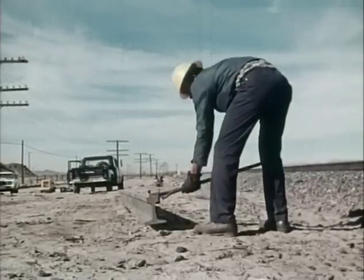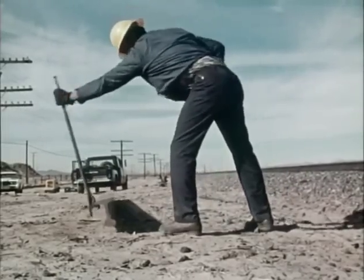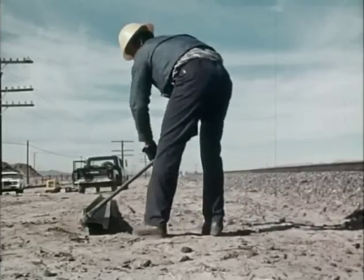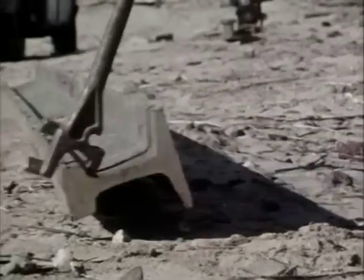A rail fork is the best way to turn rail. The correct way to do it is from behind the rail so that you turn it away from you. Why? If the rail should roll toward you, it could catch your foot beneath it.